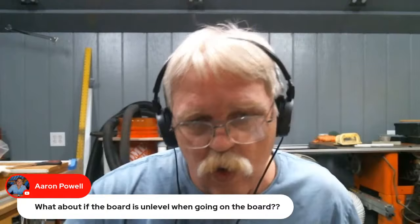So, you know, Aaron Powell talking about what if the board is not level when going onto the board. I guess you're talking about onto the spoil board, and that's a part of it. If it's not level, if it's twisted or cupped or something like that, I'll have to shim it to be able to get one flat surface, and then flip it over and then surface it to thickness from there.